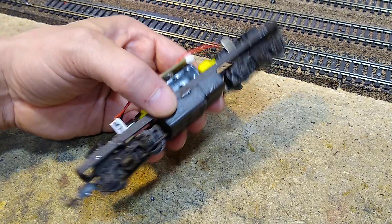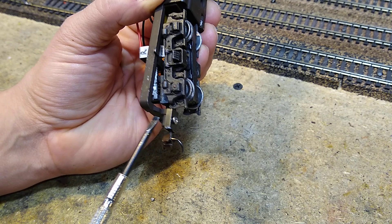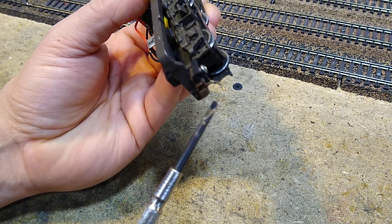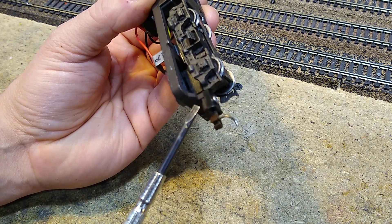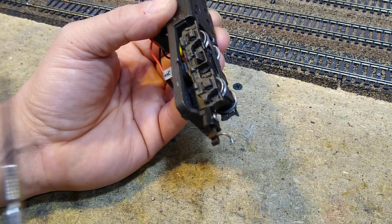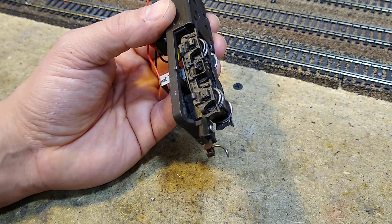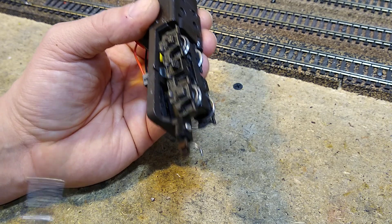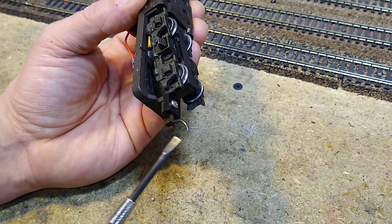On the F7, what I did was I attached to the frame — I kept the frame mounts. That is one reason I'm using plastic couplers, because the frame is live. If I used a metal coupler, the coupler would be live. If all your locomotives are wired the right way, that's no big deal, but if they're wrong in DC you'll get a little short, and in DCC you might blow something. So I used a plastic coupler.